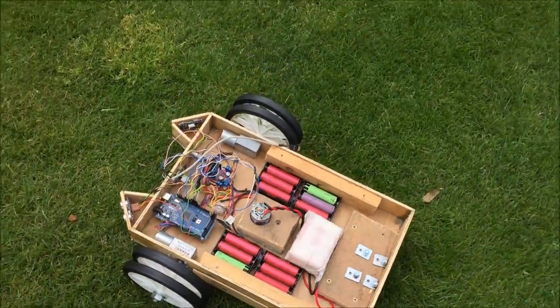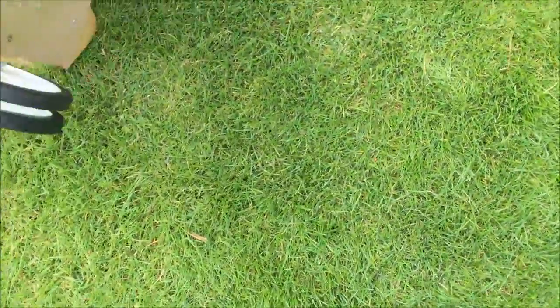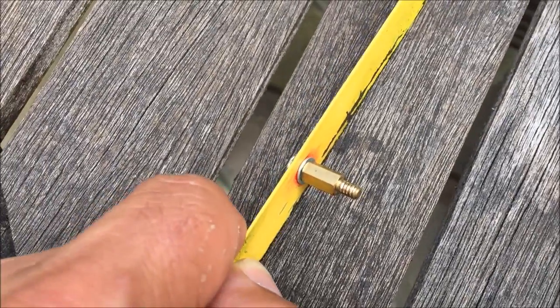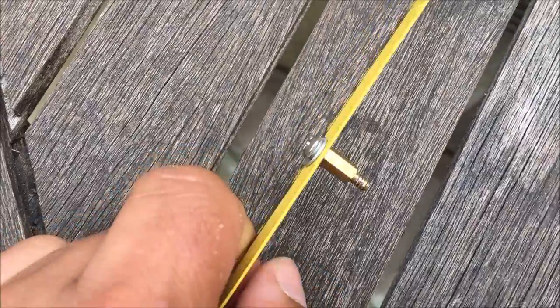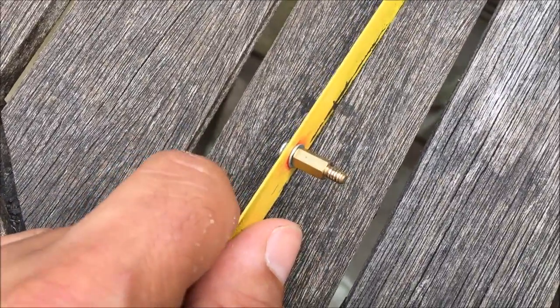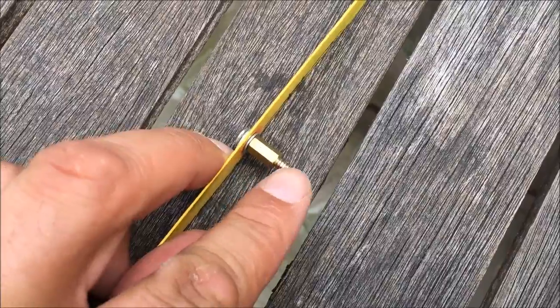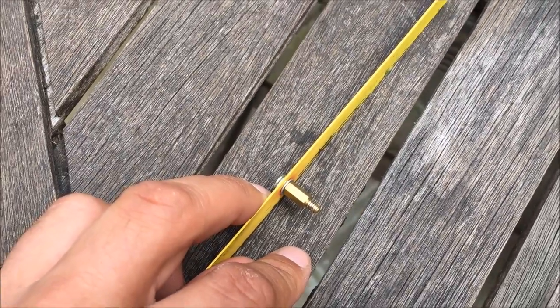Okay, as you can, I don't know if you noticed that, but the motor ran and I didn't hear the blade spin up actually, so I think maybe the blades have come free. Doink. Alright, okay. Now, work on this for a little bit, see how we do. Alright, so just a quick explanation then. The motor has got so much power that it literally just spun, and the blades didn't. They were sitting on the grass, and what's happened is it's just rotated around this spigot here. So yeah, we're going to maybe file a flat on that spigot and see if that helps us.